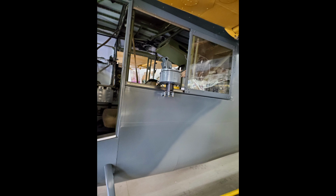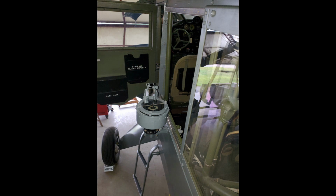Another thing they had on the outside of the cabin, they call them aperiodic compasses. These would normally mount on the floorboard just behind that one observer seat. These things would mount outside, and they had a prism on the top looking at a backwards compass thing shot through a mirror. So you could take your line of sight off a couple of mountain peaks and figure out, well, there we are. And so those sat on the outside of the airplane. Wow. Primitive GPS. These are pictures of your airplane? Yeah.